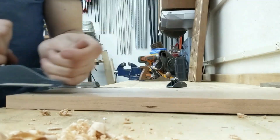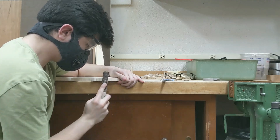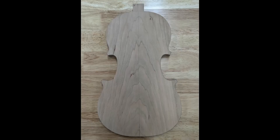I'm using this plane here, but I ended up using a sanding board with 80-grit sandpaper to bring it down. So the world's shakiest bandsaw — absolutely terrible, but for 50 bucks it's better than no bandsaw. This is my first bandsaw; I just saw an ad on Craigslist and took it. Here we are bringing down the profile. We want to cut into that pencil line. This is on the spruce top, and the spruce was softer, so along some of the rings it became a little nasty. This is back to the cherry — again, we want to split into that pencil line. You can see where we have the rough cuts from the bandsaw and all of this needs to go further.